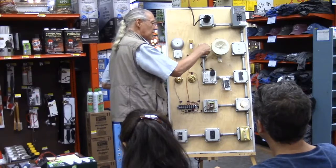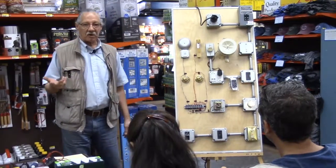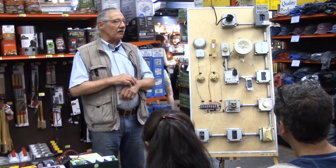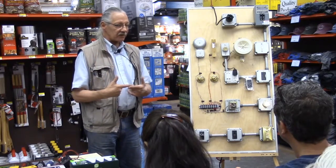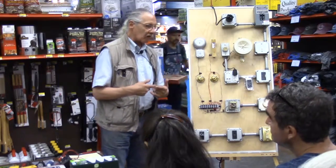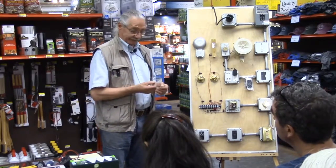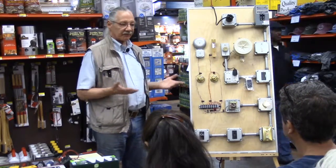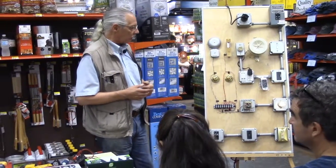I've seen a lot of mechanical problems in sockets where rivets just go bad over time. They could corrode, especially if it's an outdoor socket. If you get enough corrosion in a circuit it causes resistance and you lose power. So even corrosion on wiring can cause a problem — especially working outside, take a look at those wires and see if they're green. Clean them off and everything's good — you don't have to replace the wiring, just replace the outlets or whatever was corroded.